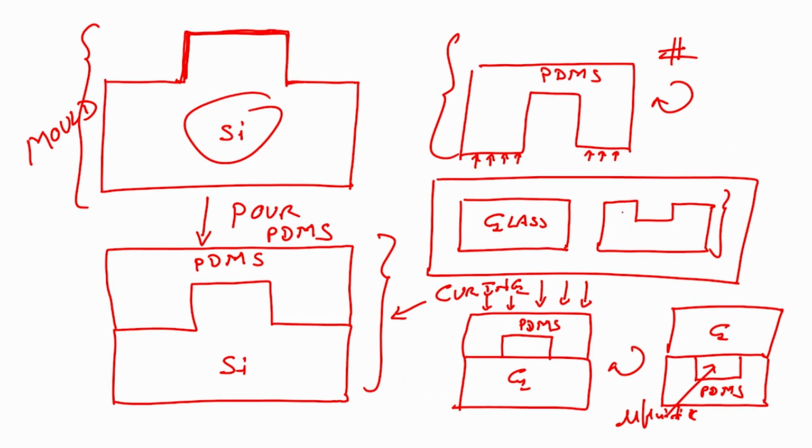and then I will take a glass and the PDMS, and load them with the top surface, which is used for bonding, facing up. I load them in an oxygen plasma system, and then we attach the glass with the PDMS to make a bond, which is your bonding technique, and apply a uniform force for 15 seconds to obtain a microfluidic device. Alright. So, oxygen plasma followed by PDMS and glass bonding forms your microfluidic device. This is what we have learned in this particular module, and let us see in the next module what we will take as a different example.